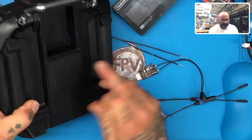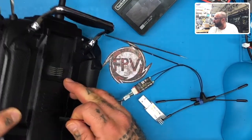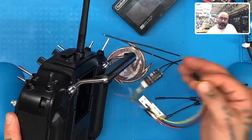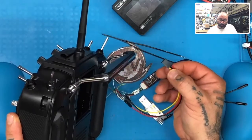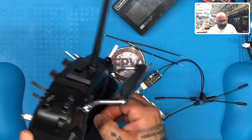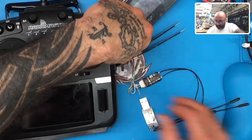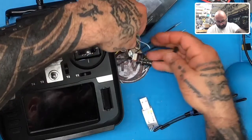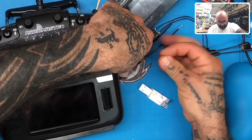Turn the radio over and you'll see five pins. Going from the bottom up, we're going to take the bottom three pins — it goes yellow, black, red, which is S-Port, Ground, Positive in that order. I'm going to flip it over, and I just need to make sure the wires don't touch each other. So I'll slide a piece of unused heat shrink over the positive wire so it doesn't touch any of the other wires.